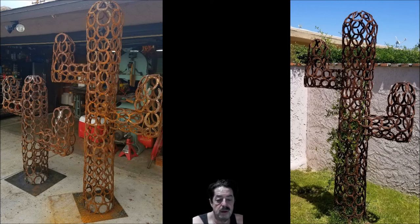How did I cut the hole? I used a plasma cutter. You can use anything around your shop to cut the hole — the hole is going to be hidden once it's on the ground anyway. You don't necessarily need a plasma cutter; you could use a jigsaw, or your 4½-inch angle grinder with a cutoff wheel and just cut a big square hole. It doesn't have to be a round hole like I did — you just make it any size you want. I did it to be able to plant a plant; if you don't want to plant a plant, you can just leave it solid. A friend made a concrete base using 2x4s, dug a square hole in the ground, poured concrete, and had bolt holes so he could set it on the concrete pad and anchor it. That's a good idea, a little more time-consuming, but you can do things like that.